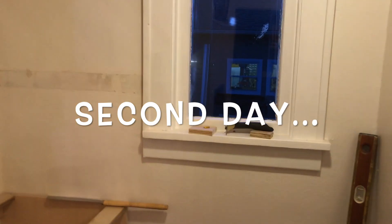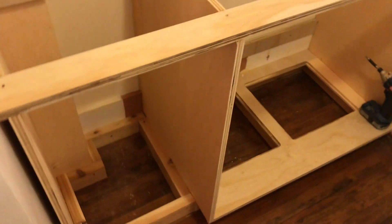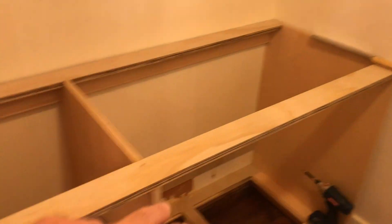At the end of the first day, it's dark outside, it's a school night, so I've got to clean up — but pretty good headway. This side of the bottom cabinet and this side of the bottom cabinet — I still need to put that panel in. The chase for all of that wire and HVAC stuff is in. I did the first quick float of the wall. I'm going to sand and do that again, get it nice and flat — even behind where the cabinets go — because the right thing to do is to float the whole wall.